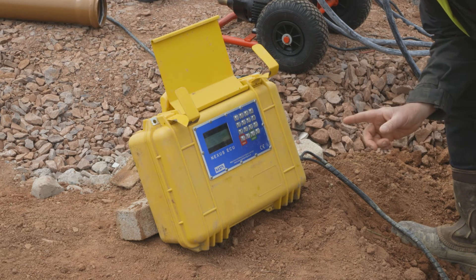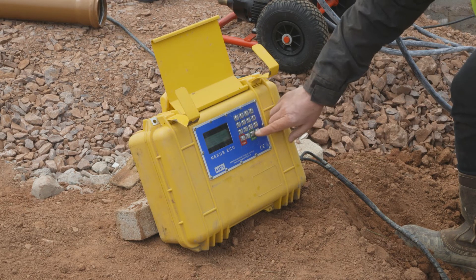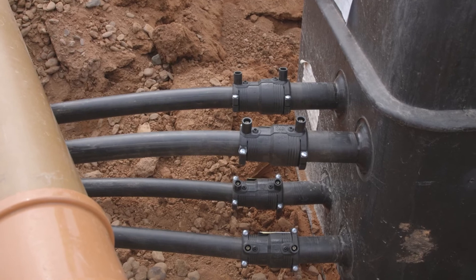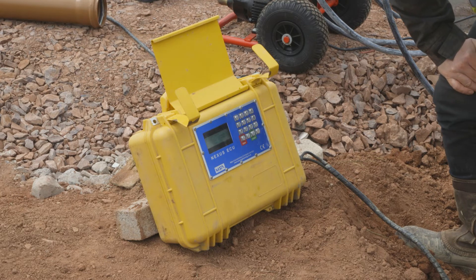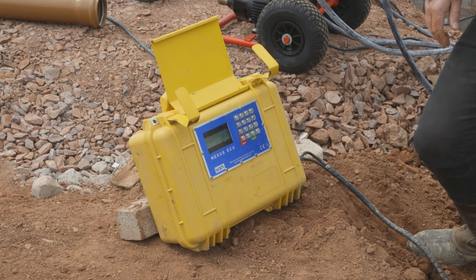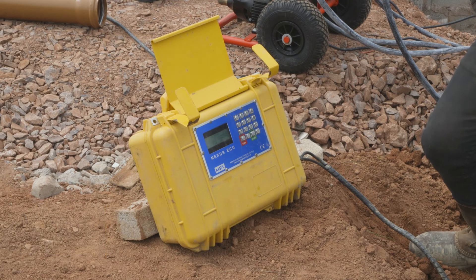The machine asks on screen if the pipes have been scraped, the fittings connected, and whether we're okay to continue. I press start, it checks the fitting connection, and it's now started to weld. It's sending power down through the fitting and that gets really hot. One of the most important things with electrofusion welding is that the fittings need a six-minute cooling time — it's important not to move that pipe or fitting during that time or you're likely to break the weld and have a leak.